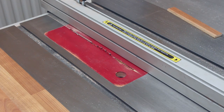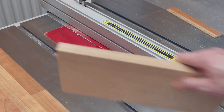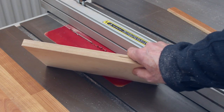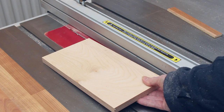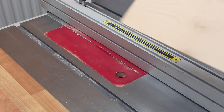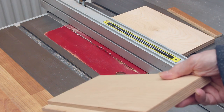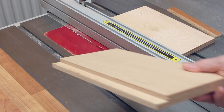The next thing is to put some rebates in. The tops will be rebated and will drop into the sides. The back of the sides and the back of the tops will be rebated, and the back panel will fit into that. It's easy to find the centre of good quality ply — just count up the plies — and I've set the height of the table saw blade to the centre ply.